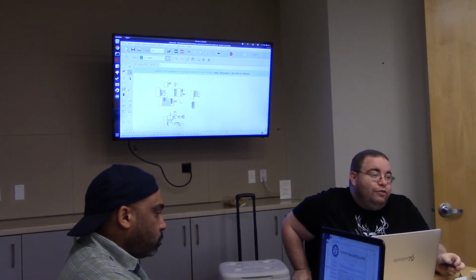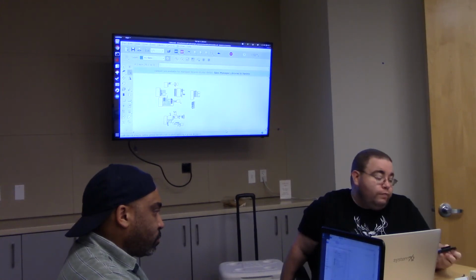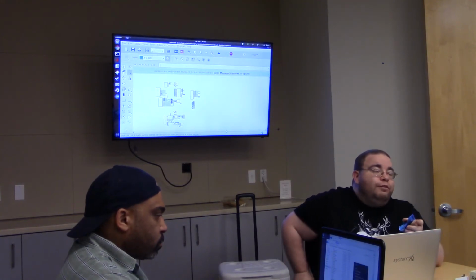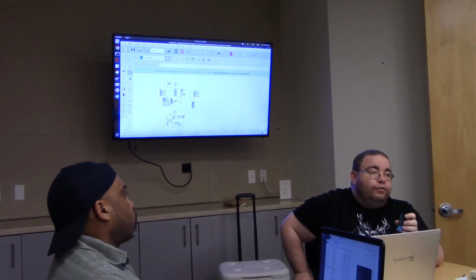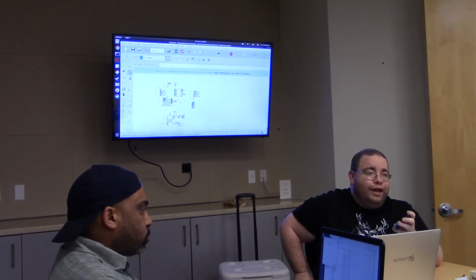Text mode would be great also, since I hope to sell these things at one point, and being able to type out "Hello World" on one without a whole lot of effort is a really handy feature. And a super high res, 640 by 480 by 4 color mode would be awesome. The current thing that I'm struggling with is every cycle I need to spit out a pixel. But that leaves really not a lot of time left over for writing pixels to RAM, because every cycle I've got to read the RAM.